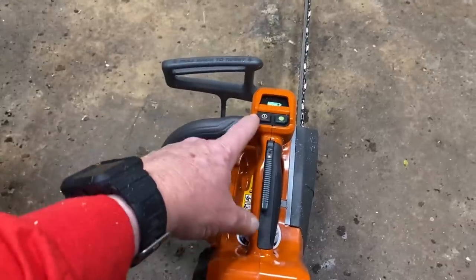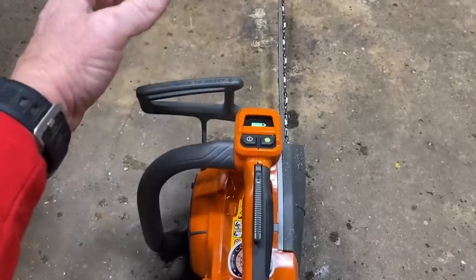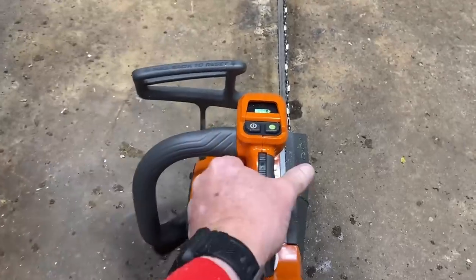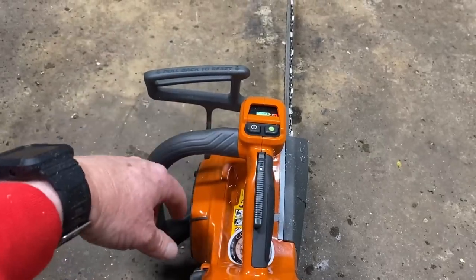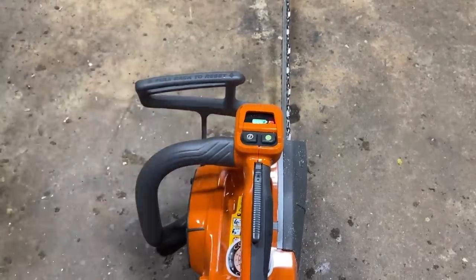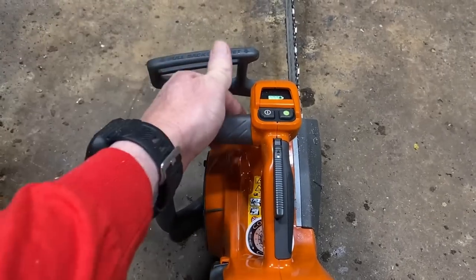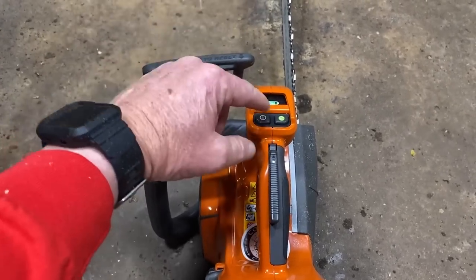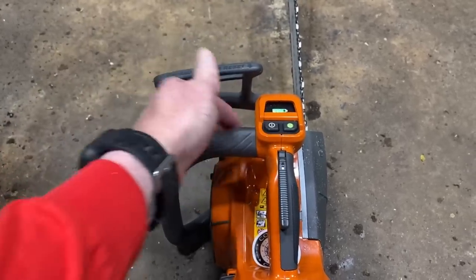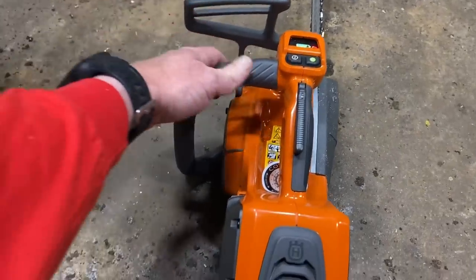You can hear it on the controls. Brake on — brake works the same way when you hit this. The chain is locked on it right now and it won't do anything even if you hit the trigger. Brake off and she's ready to go. Brake on — you just touch that right there to kill it. If the brake is off, the saw automatically powers down within about a minute or so. If you've got the brake on, the saw stays powered up a lot longer.